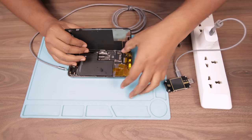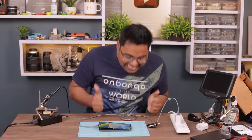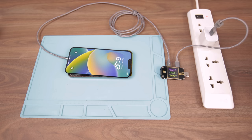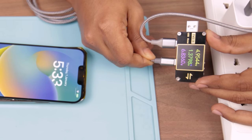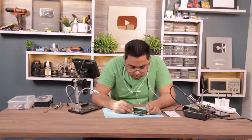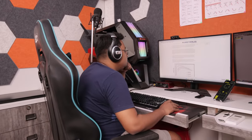After reattaching everything, the phone finally started charging and I was extremely happy. But the happiness didn't last long, because my phone was charging at a slow rate — only at 5V, not switching to 9V fast charging. I spent days trying to figure it out, tried other cables, resoldered multiple boards, but nothing worked. Then I dived deeper into fast charging research and found the problem.